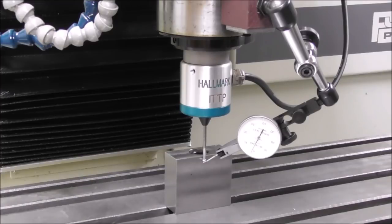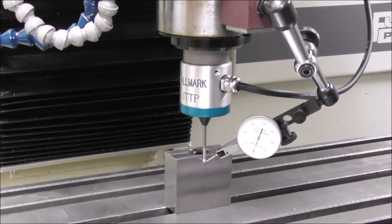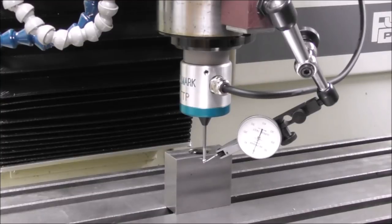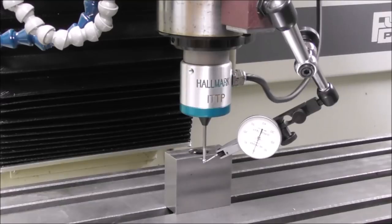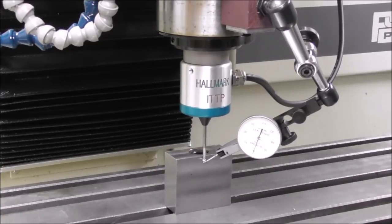I'm just going to jog up against that face at slow speed. There it is - about one and a half hundredths of a millimeter. Back off, turn it to a different position - there it's about one and a quarter hundredths. Turn to another position - it's about just over two hundredths. The idea is that each probe is slightly different; you probe up against the face in different rotary positions and note the pre-travel maximum and minimum.